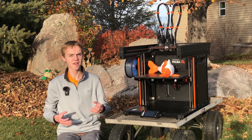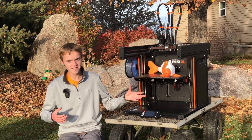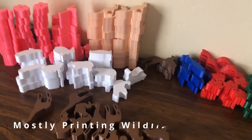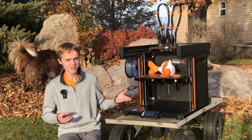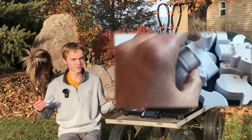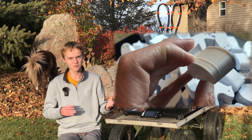Let's start talking about some of the good things I've found after using it for about three months. The first really big positive is that, despite not doing anything special, the Prusa XL hasn't had any major issues — the quality has been perfect and I've been able to sell pretty much all the prints off this machine. There was one issue recently with weird lines on a print — possibly an SD card corruption, as their SD cards aren't great — but reprinting from a new sliced file worked fine.